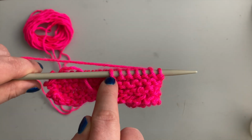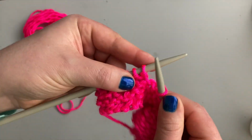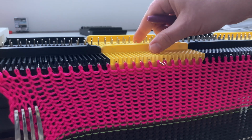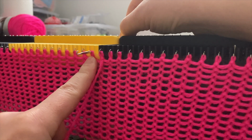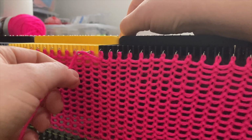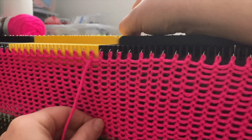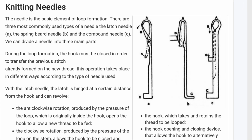Unlike in hand knitting, where a row of active stitches is arranged on one pointed needle and worked off sequentially one at a time onto a second needle, in machine knitting, each column of stitches has its own hooked needle arranged in an array or a circle. A loop of yarn sits around the shaft of the needle, and the next row of stitches is formed by catching the incoming strand of yarn in each needle's hook, pulling it through the existing loop, and then pushing or dropping the old loop off of the needle so the new stitch can take its place before returning to its home position.